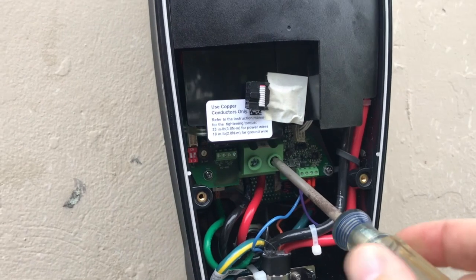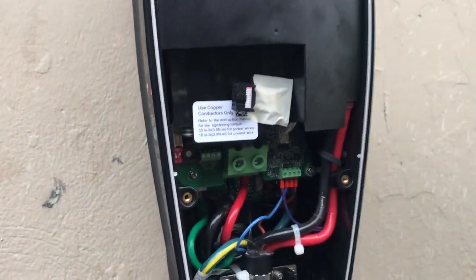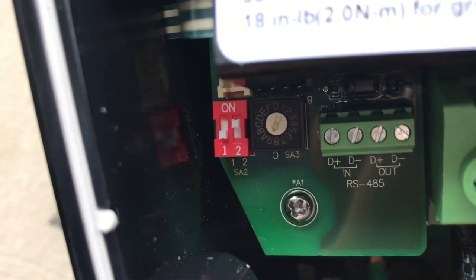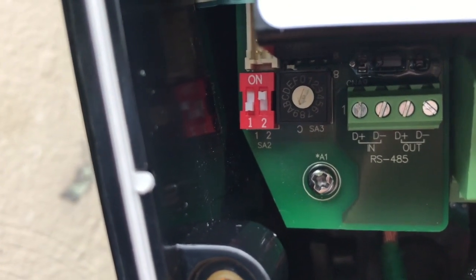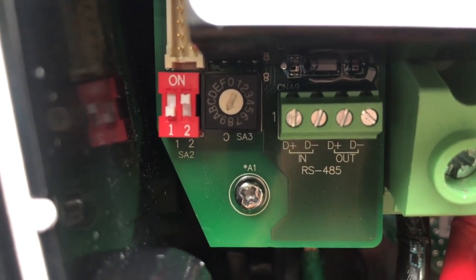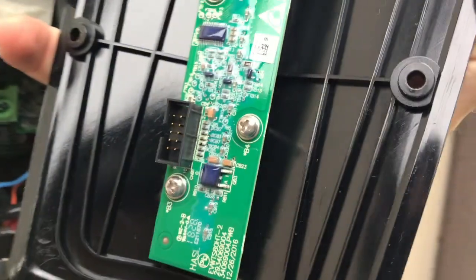Make sure to open the connector all the way and push the screw head down to make room for the cable — that provides the clamping action. Torque these to 33 inch-pounds. If your electrician carries a torque wrench, post that in the comments! Instructions say for line-to-line of 240V or less, dip switch one must be down and dip switch two always in the up position. For the rotary switch, I set mine to 48 amps, which corresponds with position number nine — read the instructions. Then the cover goes back on with the ribbon cable.